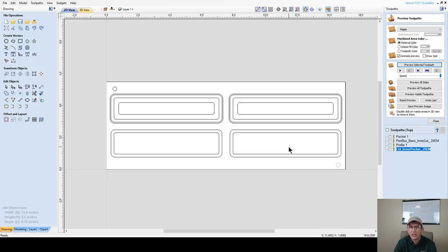And if I need to, I can check my fit and change it from there. Because I can always cut out my bottom piece before I cut out the male, because all these are going to get cut out. I can use vector selection orders and do a test fit on this if I want to. But 5/1000ths has been really good for me as far as a nice friction fit. And it all depends on your CNC machine. But we haven't gotten there yet.